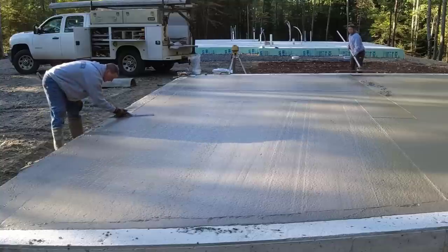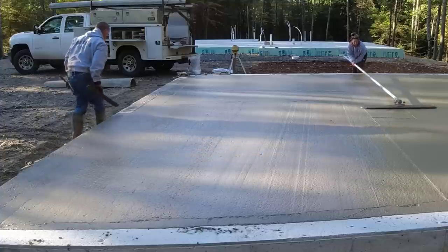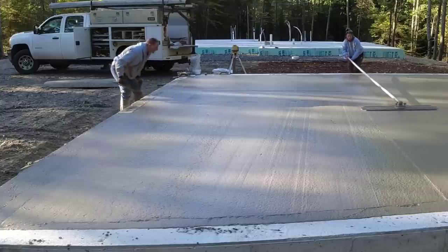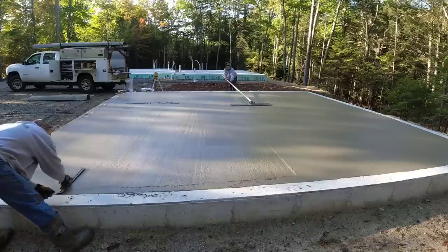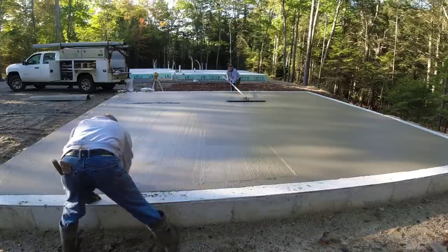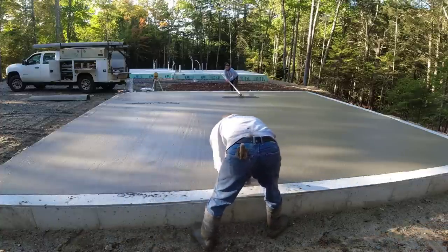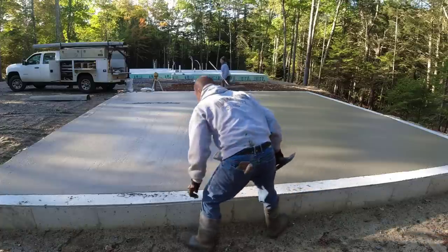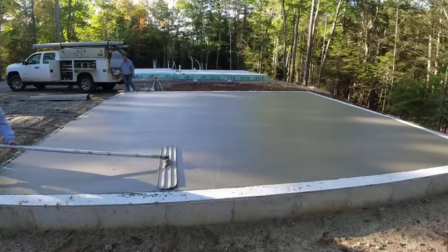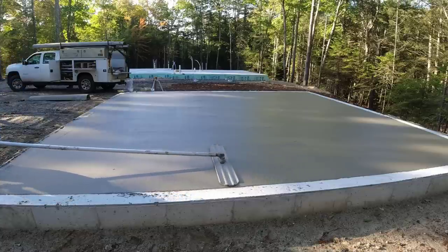I'm just magging the garage door area flat — I'm going to taper those edges right in front of the garage doors later as I finish. The finishing part of the video will be coming up in another video, so make sure you subscribe to see that. I'm going to finish this all by myself today — Tia's got to go to work, she agreed to come in real early this morning to help me. I'm going to finish this with a 30-inch power trowel, taper those edges at the garage doors, mag float my edges, and steel trowel my edges by hand. That's how we do a garage floor. Thanks for watching — see you on the next one.